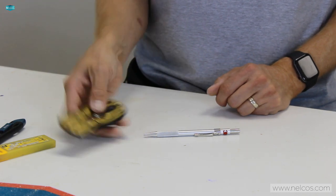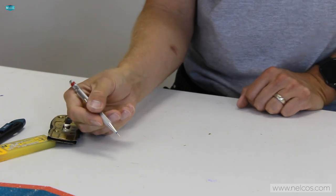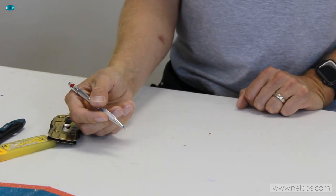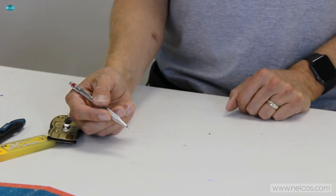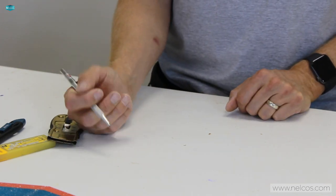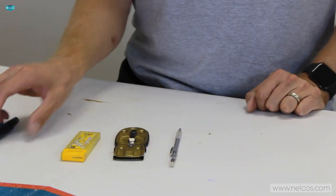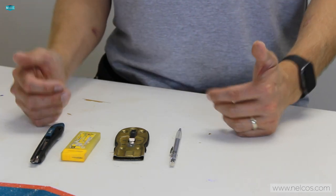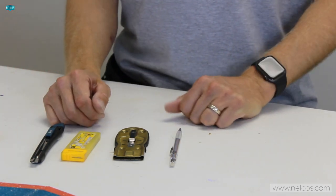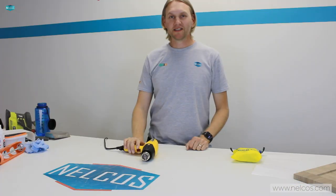Our air release tool is lethal — it's a needle. This thing will penetrate into your skin three-eighths of an inch with ease. Always make sure that it's retracted back in, because you've always got these tools in your pouch. You want to make sure that everything is always retracted. It's really easy to catch yourself, and you will eventually catch yourself, but hopefully it's not too bad.